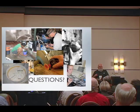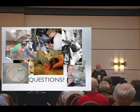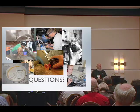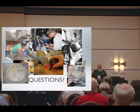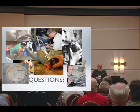You don't really need to dress wheels per se, as my understanding. Diamond plates can be dressed when the machine is turned off, the wheel is on your plate, and you get it wet, and you get a dressing stone, which is aluminum oxide, kind of hold it like a dagger and grind center to edge while you slowly turn it, and you'll end up like putting spokes on a wheel. You're putting force on the diamond sideways, which will break it and make it more aggressive again and very random in height. But you only do that when your diamond pad has worn enough that it's supporting the glass more than grinding the glass. I don't think I can get away doing that more than 3 or 4 times to a plate. So it's not something you want to do every Friday.